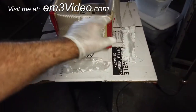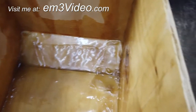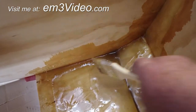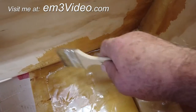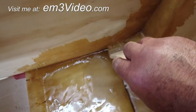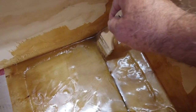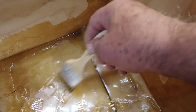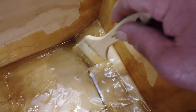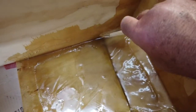I did the bottom and the corners and double-reinforced everything. You apply the resin first on the plywood, then put the cloth and soak it in. Make sure that you tap all of the joints really well — when you see white cloth, that means you need more resin. You're going in tapping with the brush and adding more resin. Don't put too much pressure or you'll pull the cloth out of the corners — you need the strength in the corners.